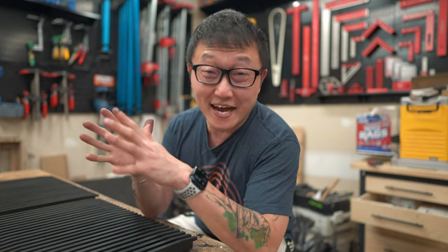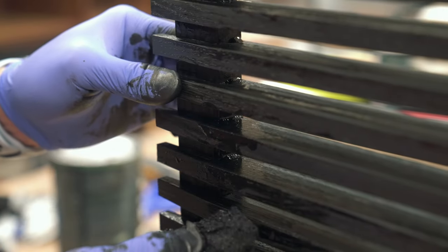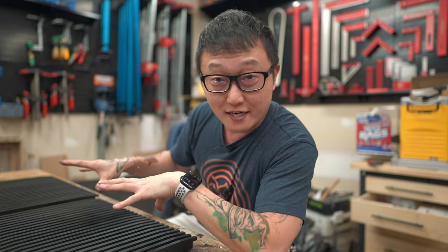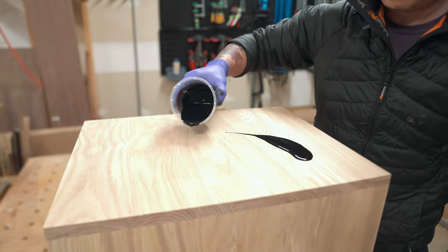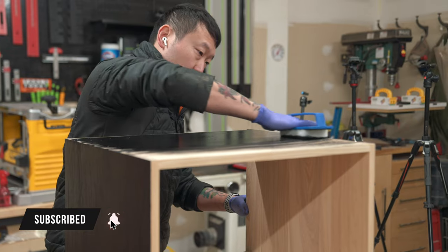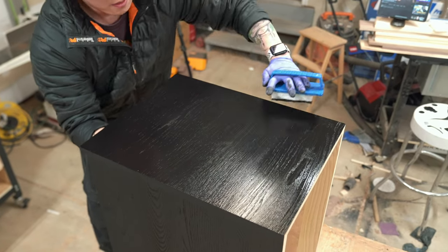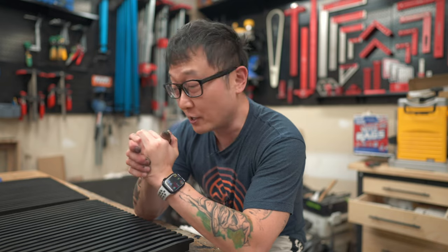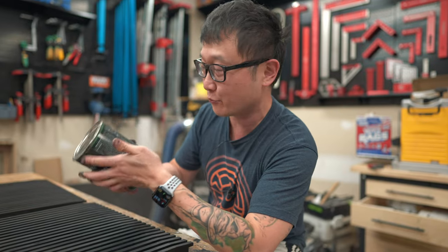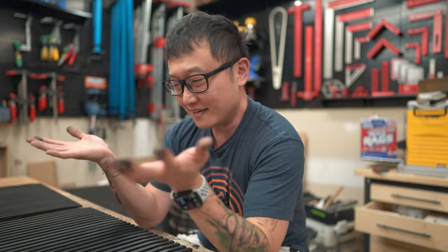Once the stain has been applied uniformly across all surfaces, we don't need to let it sit — just take some rags and start wiping it off. I ended up using four, maybe five ounces to cover both doors, mainly because I really needed to saturate that pad to get the stain into those tiny tight corners. For larger projects, the process is pretty much the same except I start by pouring the stain right onto the surface and using the white pad to spread it out evenly. And just like before, it's always a good idea to take a last pass along the direction of the grain to even things out and remove any lap lines before wiping everything off. I didn't see that step in Rubio's instructions, but people have told me that when they didn't do it, they ended up with swirl marks or lap lines — so I think it's just a good idea, and I've always had good results with it.